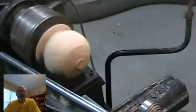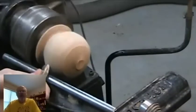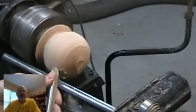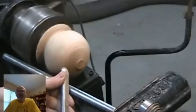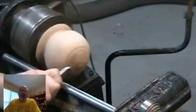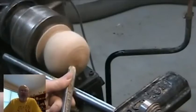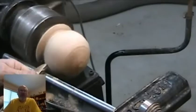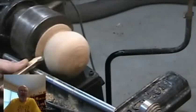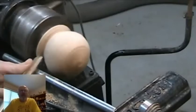Here I'm putting a piece on the lathe and free-handing the shape to get it reasonably close to the sphere. I'm not going to make it that close to a sphere on purpose so that you can see how working with cup centers can actually get you pretty close to — or exactly to — a sphere, even if you're starting with something quite out of round. I'm using a large bowl gouge here; there's no real need for this size specifically. A smaller bowl gouge is actually a little bit easier to use, and a spindle gouge would certainly work for much of this work also. I just tend to use what's sharp.